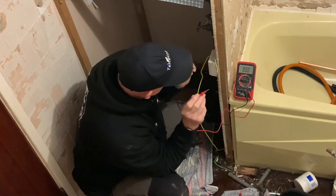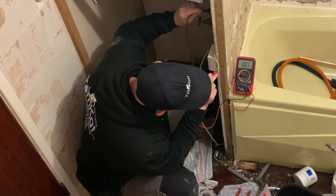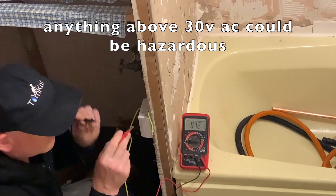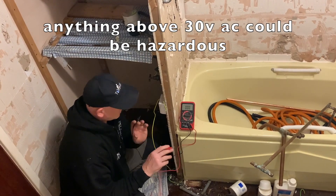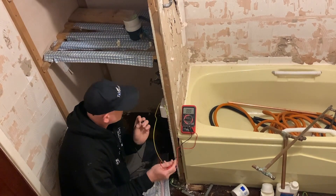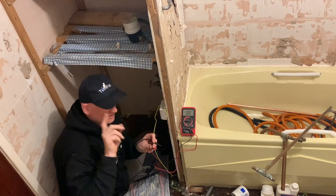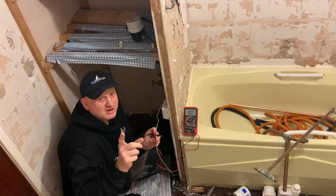Let's see what voltage we've got going through. Sticking the neutral probe onto this copper pipe, you can see we've got 57 volts AC going down the earth. The earth went everywhere in this flat — to all the taps, every pipe. We had to cut them all out so we could keep the power on, otherwise Tom was getting electrocuted. That is a good example of why gas engineers need the non-contact voltage indicator, because it picked it up for him straight away.